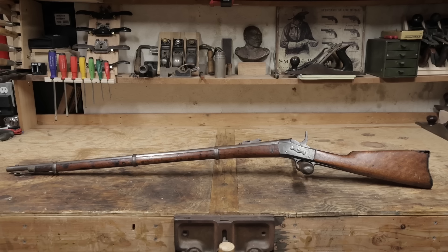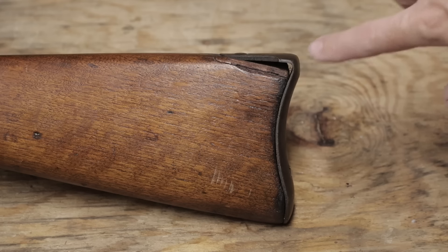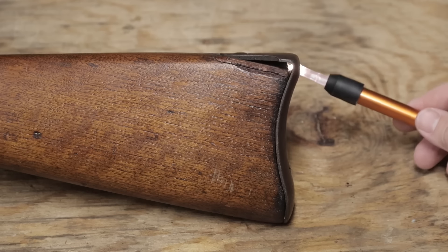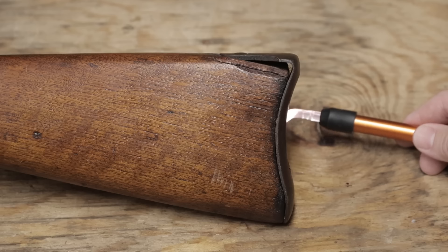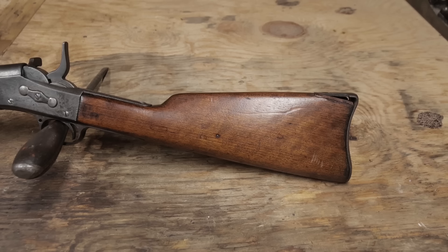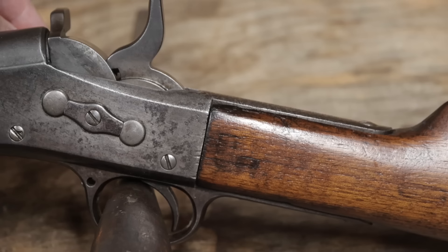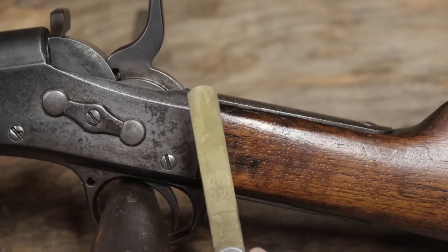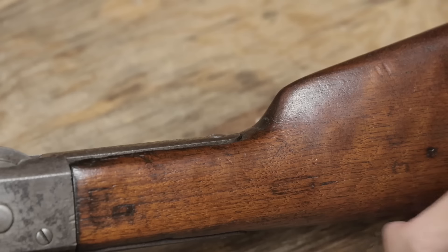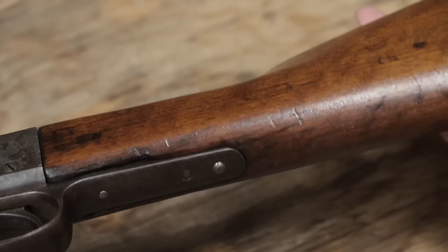However, the condition leaves a bit to be desired. Most pressing is what's preventing me from heading to the range right now, and that's the condition of the buttstock. There are chunks of wood missing from the heel — that's not a big deal — but what is, is that there's a gap between the butt plate and the wood. The wood must have shrunk over the years as it dried out, because at the front there's a gap as well. It's not enough to shine light through, but a .012 feeler gauge easily fits in there. The fit at both ends should be tight in order to transmit recoil from the action to the shooter; otherwise it can cause cracks, which can be seen here on the top and here on the bottom.